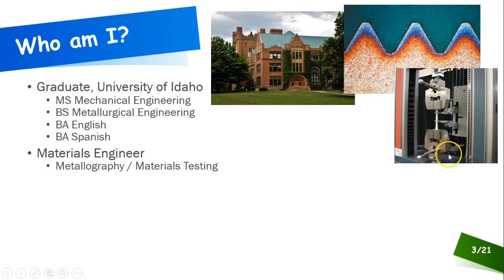This is a tensile tester. And essentially, you're going to take the material that you're testing, which is a specimen here in the middle. And once you've got your specimen made, then you're going to slip it into these mounted grips here. The one that you see at the bottom is stationary. It doesn't move at all. But the one on the top, you can see, is attached to a frame that moves up and down. And so you stick your specimen here in the grips.